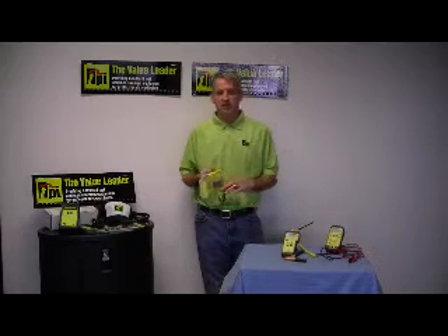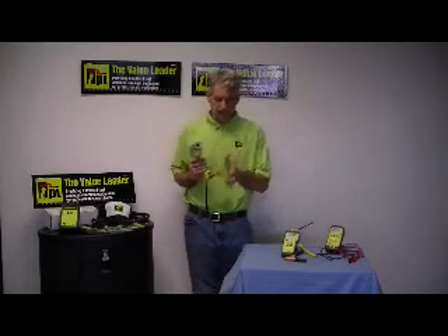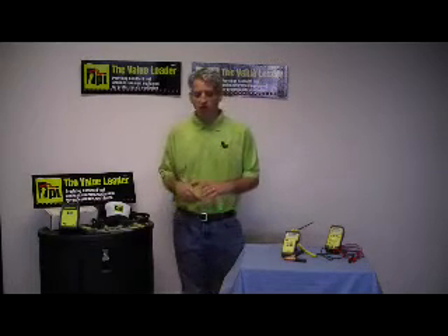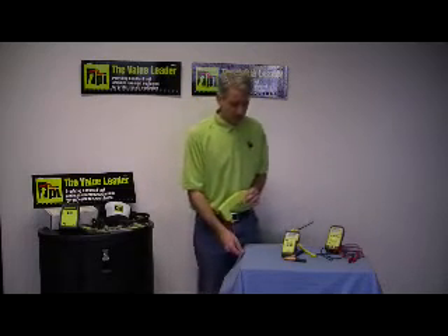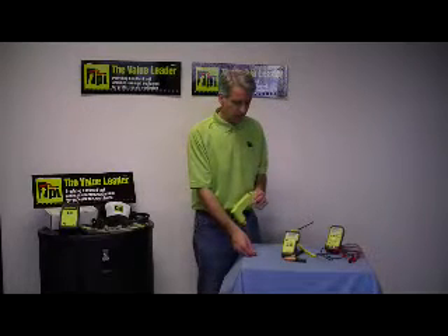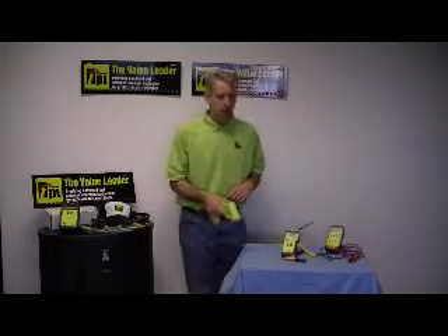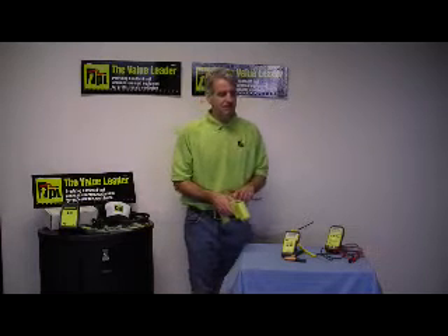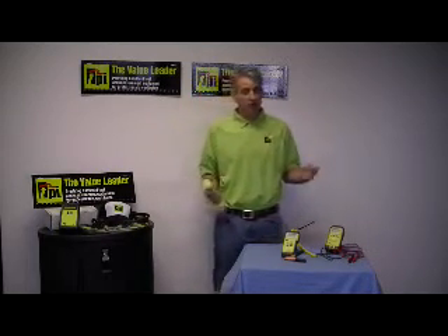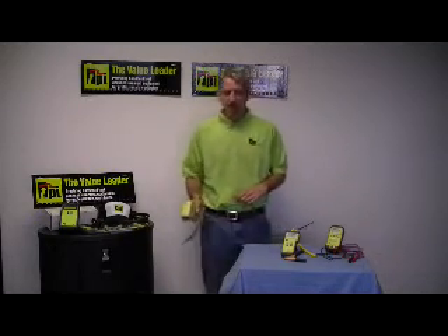What makes this gun unique is the fact that it has adjustable emissivity. So if I want to take accurate temperatures on a pipe, I could use this K-type thermocouple probe — any K-type thermocouple probe is going to work in the handle of this unit. I can turn the unit on, adjust it to K-type temperature reading, and apply this to my pipe or whatever surface I want to accurately read. Once I've taken that temperature, I can adjust the emissivity after removing the probe. Now I shoot the gun with my laser and adjust the emissivity so that the temperature matches the reading I had with the standard K-type thermocouple probe. Then I know I've adjusted the emissivity in such a way that I can shoot that pipe again and again and get an accurate reading.